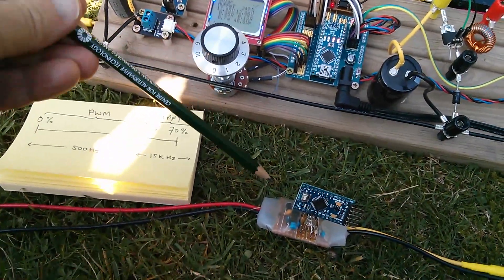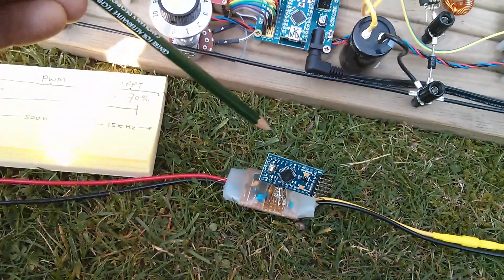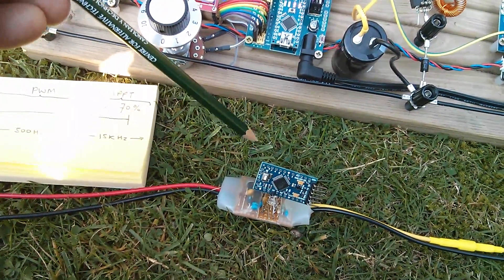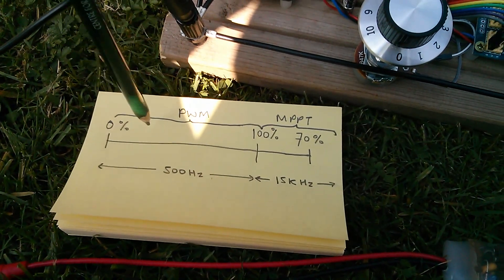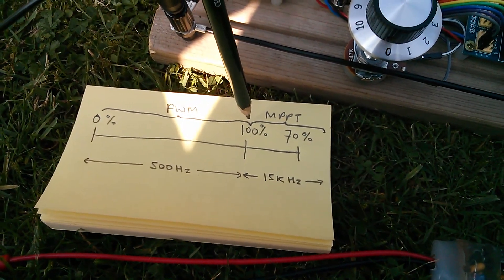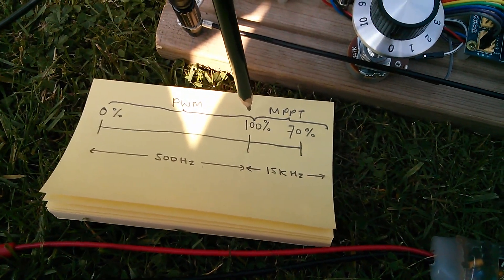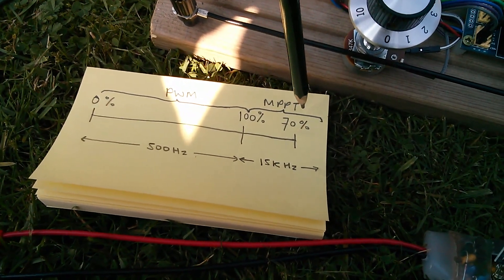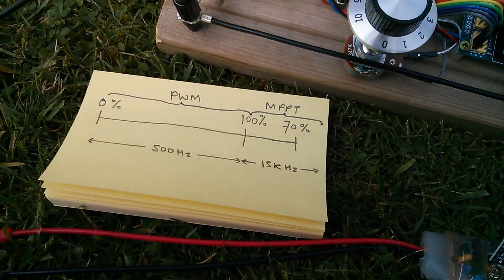The reason I think this is going to help is that the PWM unit is very primitive. All it does is wind the PWM value from 0 to 100% and watch the battery voltage, trying to get it to sit at the target of 13.5 volts. Well that will be done within the 0 to 100% PWM at 500 hertz section. Only if taking it to 100% doesn't bring the battery to float voltage — if it's still below 13.5 volts — will it then switch into MPPT mode and wind the percentage back down.